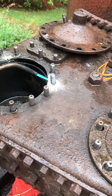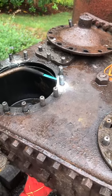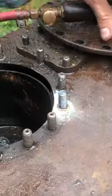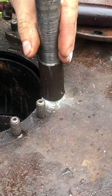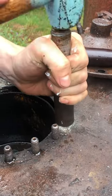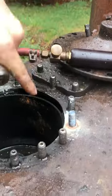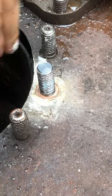These are ferrules. We're just heating everything up good. Now what we're going to do is take this guy here, we're going to bang it in and bang it to shape. So this is a snug fit on the stud — the ID is the same as the major diameter. You see what happened there? You mush that copper ferrule right inside to create a steam-tight seal.